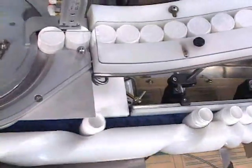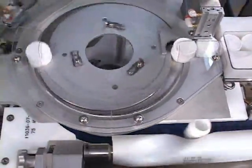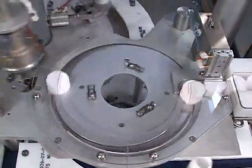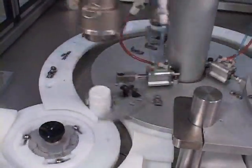At the rotary capping station, the bottles are mated to the caps. Containers are fed into each rotary station by feed screw. Each rotary chuck station has upper and lower grippers to stabilize and align the cap and container. A neck guide centers and positions the container to align with a cap on the rotary chuck.